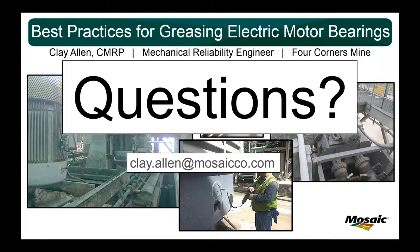All right, awesome. Someone else is wondering, for your inaccessible motors with long grease lines, are you concerned about how long it takes for grease to get to the bearing and the condition of the grease once it gets there? Yes, that's a great question, something I'm working through right now. For those log washers, those lines are about 15 feet long, and the walkway is elevated from the motor. From what I can figure out about grease, the grease sitting in those lines gets hot and cold from daytime, nighttime, and the sun beating on it, and the oil will come out of the thickener. I think that travels down the tube and gets into your bearing. So that's really what keeps your bearing going, right? The oil in the grease, not the actual thickener.